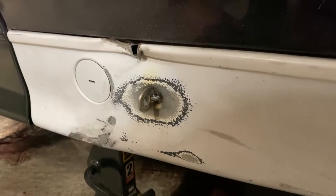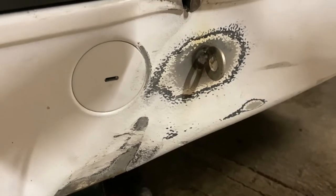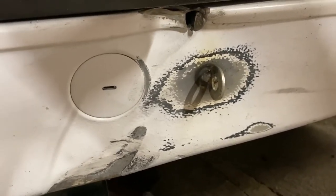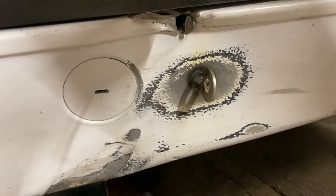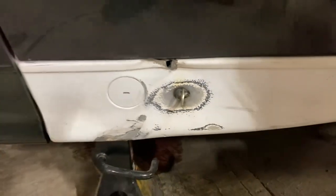You want a little more than a tack, but you don't want to weld it on all the way around — that would just be overkill and then you'd have to cut it off anyway. A tack would probably be too weak and just bust right off, so a little bit more than that. Make sure it penetrates good on both sides, and now we're gonna start pulling it.